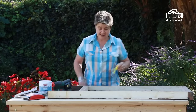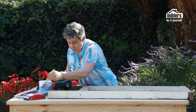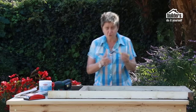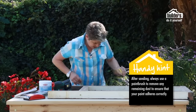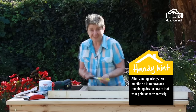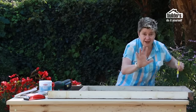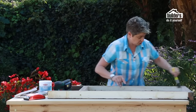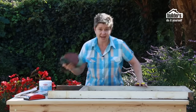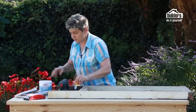From when we started, this frame is now smooth — really nice. We've taken off all the excess glue and bits of paint. Always take a paintbrush and get all the dust off, because dust and paint don't go well together — it will literally just flake off. If you had a new frame from the builders, you would start at this step, doing a light sanding just to even it off and remove any splinters.